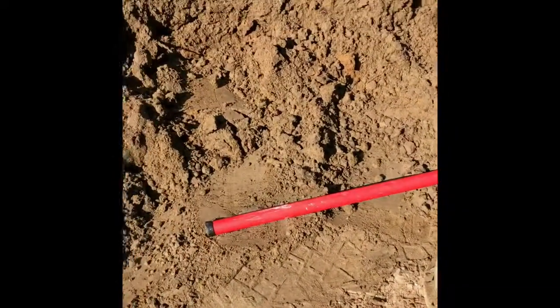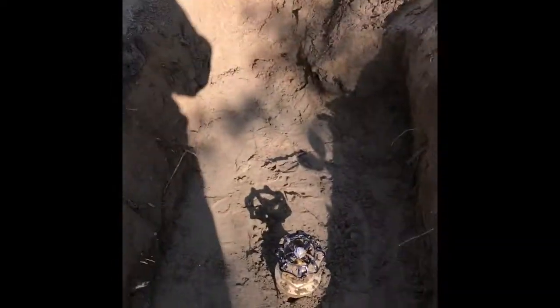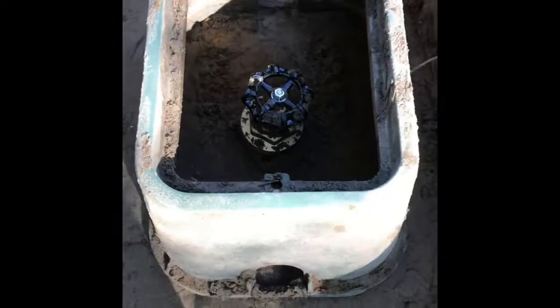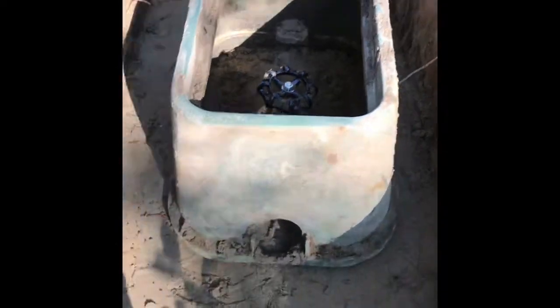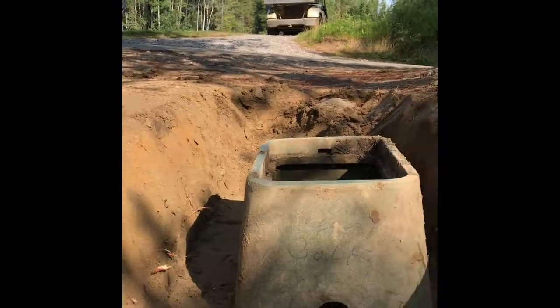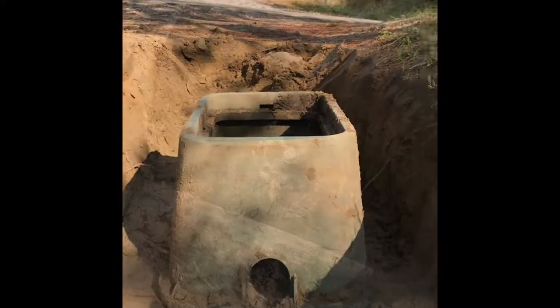So as you're backfilling, I like to throw in a couple inches of my dirt over here and then pack it all back down so we won't run into settling issues after. You have to make your valve box level, which we're about to be at here, so we'll put this on and see how it looks. There we go. Valve centered in there nicely, and we can see we're at an acceptable height. So now we just backfill her up.